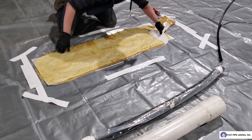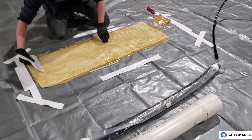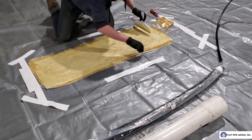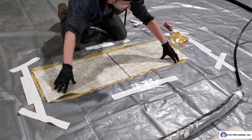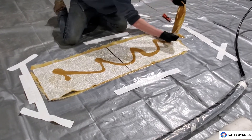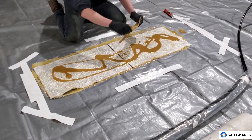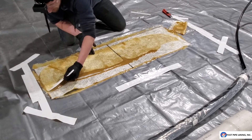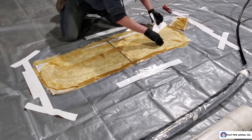Make sure that the white is gone. Once the white has been completely saturated, scrape off any excess as you do not need it — extra resin will only hinder you when installing inside the pipe. Now, once you have saturated the lace side, flip it over mat side up. Use the rest of your resin — you can pour liberally now. Repeat the process on the mat side, working from center out to the edges, as it is hard to get the resin back onto the fiberglass once it falls off.